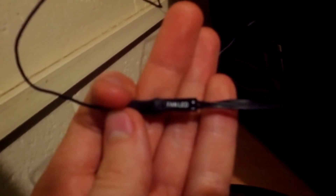They say fan LED in plus and minus. So that allowed me to turn the LEDs on and off when I wanted. But I thought, perhaps if I turned them on and off at the right frequency — some kind of multiple of the speed that these fan blades are spinning at. And what I figured out is basically all I did was this circuit here.